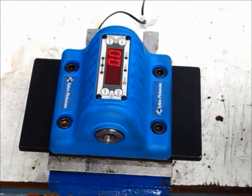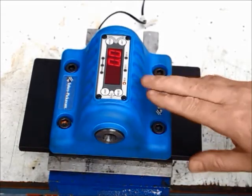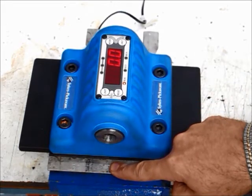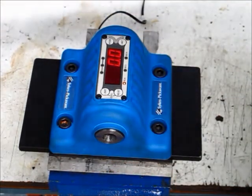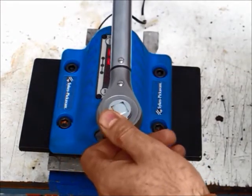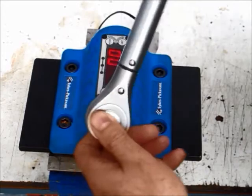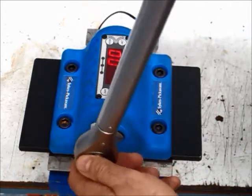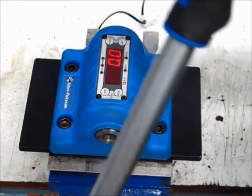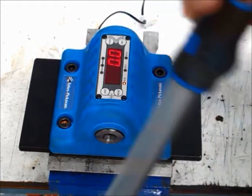Wouldn't need any action for now. So that's how you use a torque checker. What's very important is that it's securely mounted in the vice. Also, the wrench is used in the vertical or pure horizontal plane — anything in the middle will give a false reading. Hold the wrench in the centre of the handle and pull in an arc smoothly.